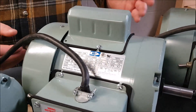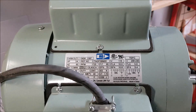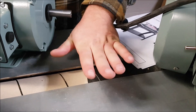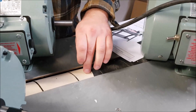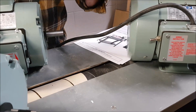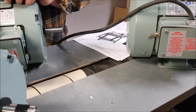I have other videos talking about this, but the way this drum is set up, the drum is set below the table, the sandpaper lifts off, and you've got an air gap between the sandpaper and the drum. You're never forcing the sandpaper into the wood, so you take very little power away from the motor.